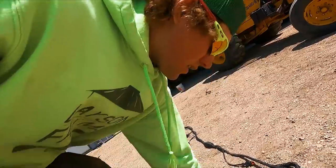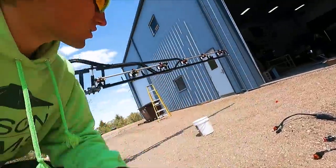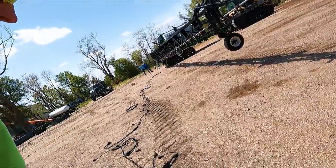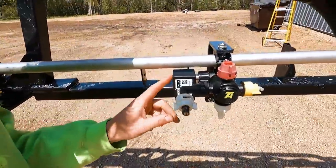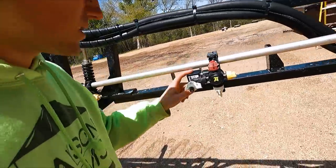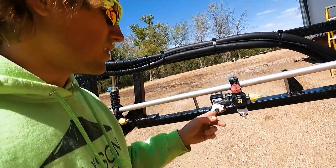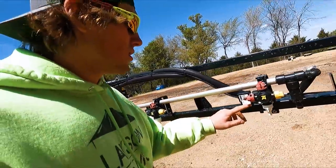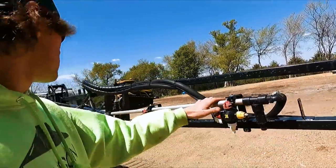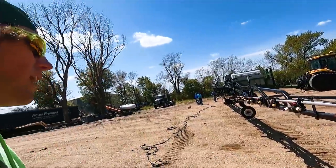The wind's picking up, of course. They are running this wiring harness on the other end of the sprayer on the other boom. We're going to put it on, fold it, make sure that we don't have any pinch points, then do this side the same exact way. Basically, this wiring harness runs the whole length of the boom and each nozzle gets a wire going to it — to this little nodule which pulsates the product. We'll be getting a different nozzle that will pulsate to keep the correct tip pressure no matter what speed you go. Each nozzle can do up to one gallon per minute, so 72 nozzles on here means it can do 72 gallons per minute through the boom.